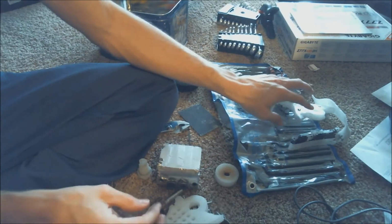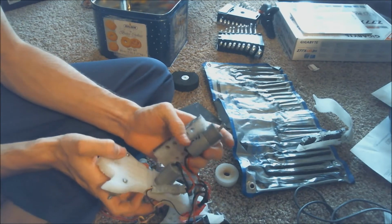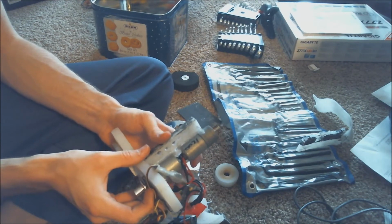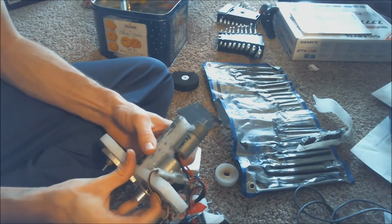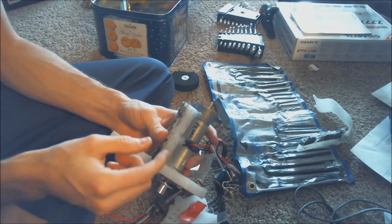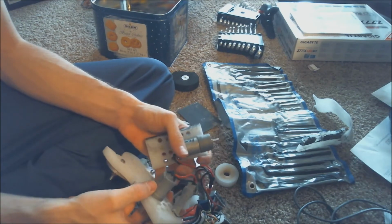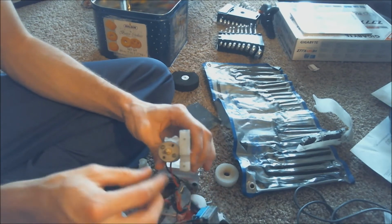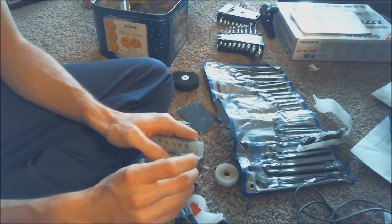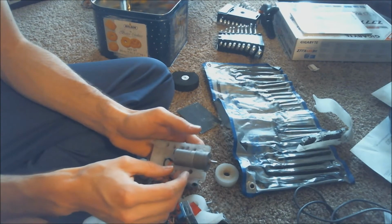Now he's all taken apart. Oh, I wanted to show you what insides I'm using. My motors are the 1000 RPM motors that you can get off eBay, or I suggest getting them from kitbot.com. Apparently there are some batches of these 1000 RPM motors that are not quite as good as the other ones, and he knows how to determine the difference between those. And he only sells the good ones on his website. He'll sell them to you battle hardened, which means that he pretty much just Loctites all of these screws that are in the gear head, because sometimes these motors are susceptible to the gear head coming off of the motor, where the faceplate connects to the motor.